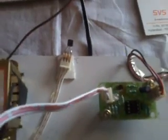And here we are using port P0.28, which is connected to the LM35 precision temperature sensor, and we are getting the data in the form of degrees. 10 millivolts equals 1 degree, and 300 millivolts is called 30 degrees. That's why we are converting into Fahrenheit. The Fahrenheit formula is F equals actual value in degrees times 9 by 5 plus 32. It will display the Fahrenheit value.